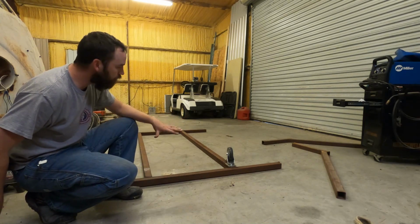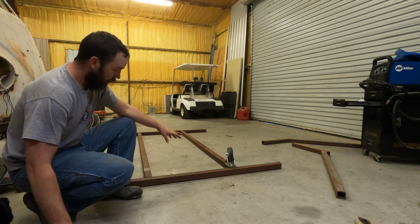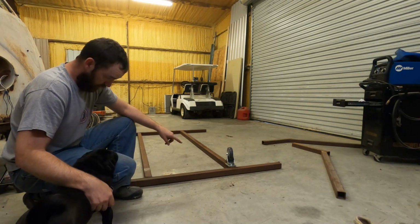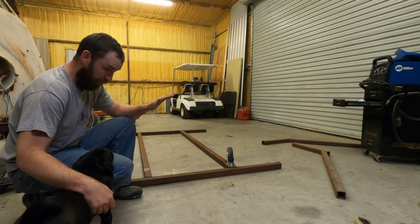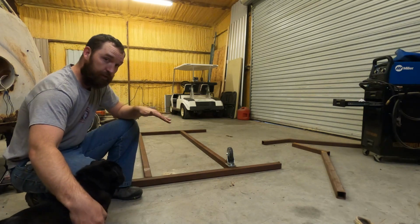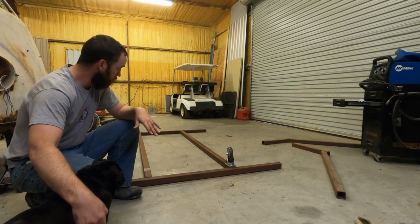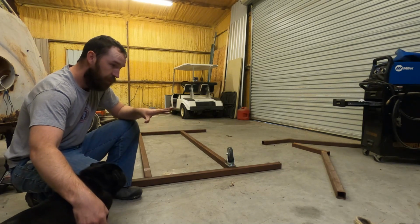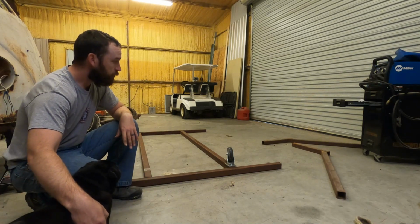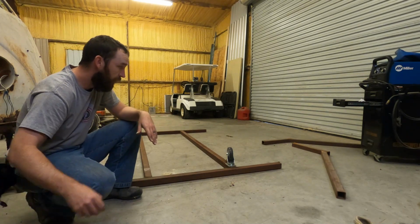So then once I get all 4 wheels mounted on, that's my good straight, per se. And then I can roll it underneath the truck. I'll do measurements from that to the body, to the frame, and try to get it as parallel to these poles as possible. And that should level my entire truck the best I can. Then once I can get that all perfect, I'll build the brackets from this that go up. And once that's done, I can actually weld those on later. I don't have to put them on right now.